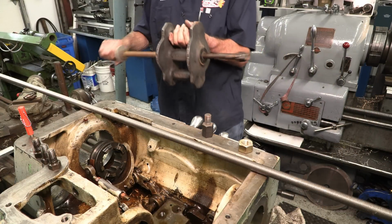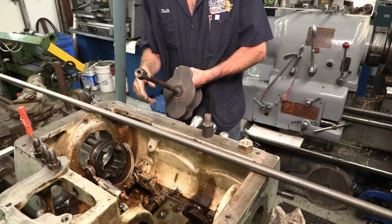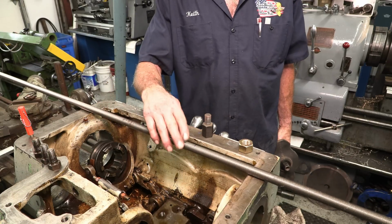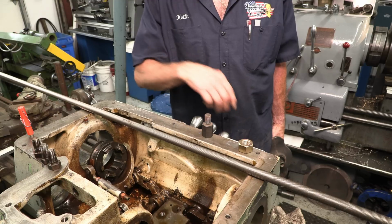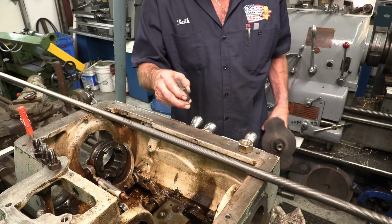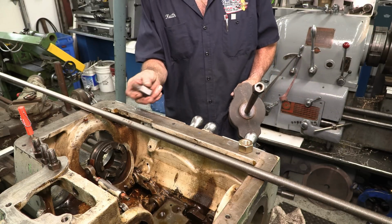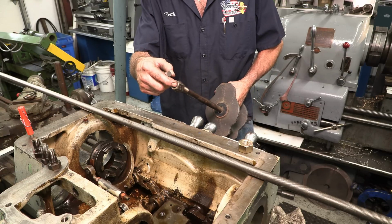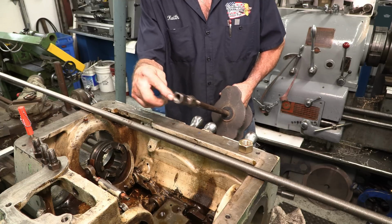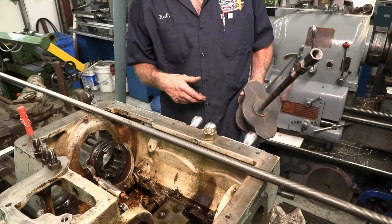Okay, we have this little baby slam hammer here. We've got all kinds of ends here. In fact, we won't even have to do anything other than cut this length of 3/4 National Fine rod. 3/4 is the diameter of the rod that goes through that inner shaft. We're going to cut this off here. This is the original puller combination 3/4 5/8 that came with this, and then I needed a 5/8 to 3/4 female, so I can screw this onto one of the threads, put the nut on the other side down in there, and then we can draw that shaft out.